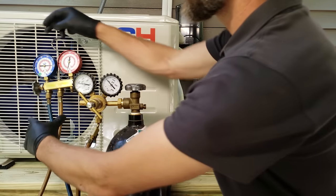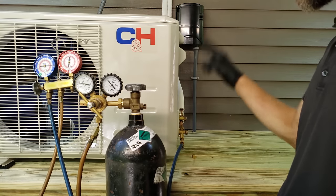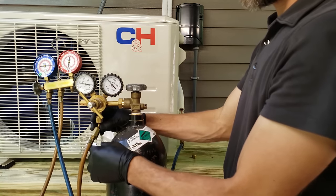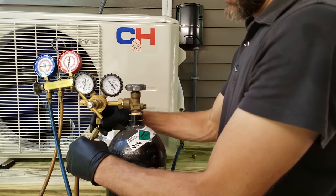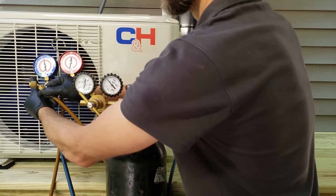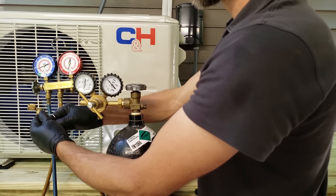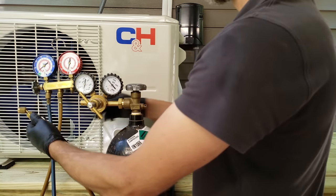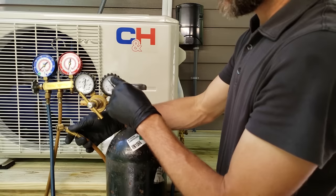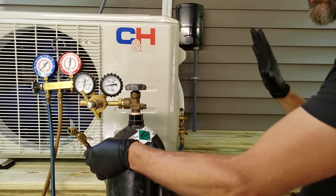We're going to shut our valve, disconnect, and let our pressure out. Make sure to not shoot the valve core depressor out when releasing pressure — just be careful of that. This handle is shut now, and we can release the pressure out of our nitrogen tank as well. We'll back that thumb screw out again, disconnect, and set up our vacuum. Now we're going to do our vacuum procedure. These are valve core removal tools — this is a 5/16ths valve core removal tool that fits on that port. This one is only a quarter inch so it won't fit at the bottom port. You can actually attach any of the other hoses or the vacuum gauge onto the quarter-inch ports without a problem.